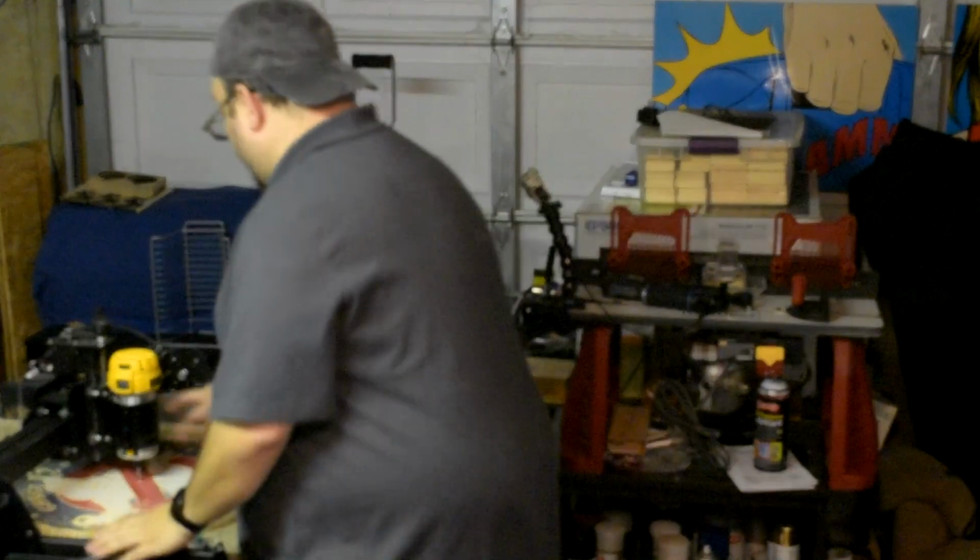Alright, cool. So what I've done is I have it engraved on the CNC machine. It's completely finished. I'm just going to turn off the machine, and I'm going to take it off. The reason I'm clear coating it with spray is because it's watercolor and I don't want them to bleed into each other. So I'll clear coat it with spray once or twice, let it dry and harden, and then I'll go and put some poly coat on it, and maybe we'll even buff it up.